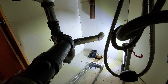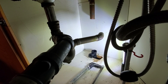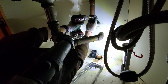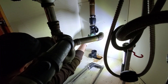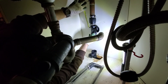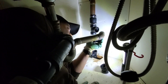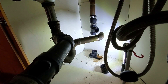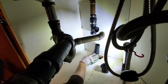Alright, so I glued the clean out in and the vertical piece of pipe. What I'm going to do is get the fernco onto the vent. The T is going to be roughly in line with the trap arm. That looks alright — in this case, I'm purely just eyeing it out.